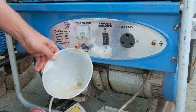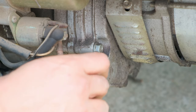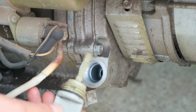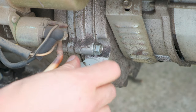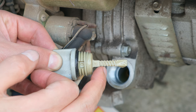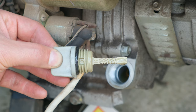If you don't want to overfill and waste the oil, periodically check the level. I can actually see the oil building up in this tube. I can take the knob, screw it in, and do a preliminary measurement so I don't overfill. At the moment it still requires more oil as it is still below the L level. Now retaking the oil measurement — just be careful not to cross-thread this, it should go in very easily. The oil level is sitting just about right, actually more on the full side, so I'm going to return the oil filler knob — the generator is now full.